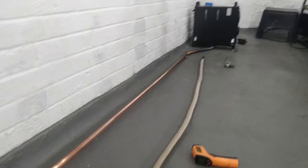So I'm outside here with the exhaust - you can't touch the copper, it's getting pretty hot. There's no condensation dripping out yet - it's only been on for 10 minutes. The fumes coming out feel a little bit moist, I wouldn't be surprised if we did get a little drip of condensation in a while. I'm trying to get a reading off it but it's just reflecting - 14, 15 degrees the same as the concrete. But my hand says it's very hot, you can't touch it.